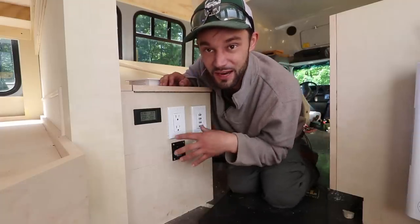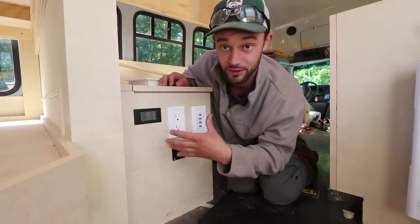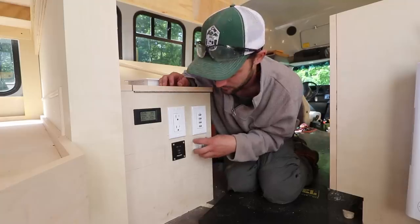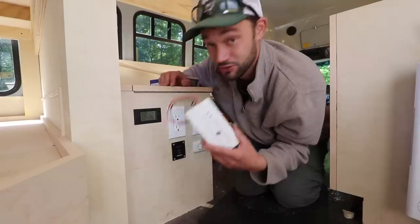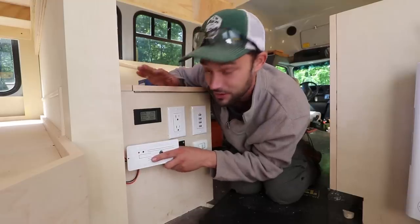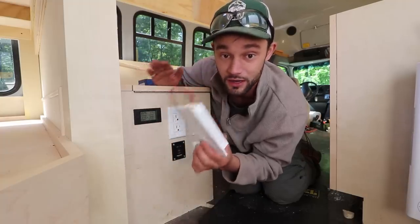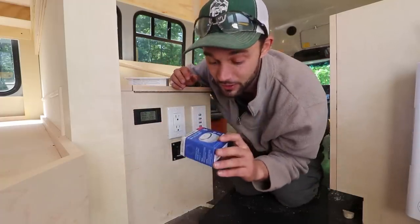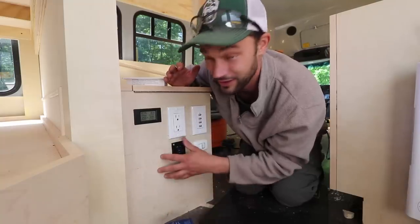Here in the school bus is our main control panel on the side of the couch. We put it here because all the electrical systems are inside this couch — easy to wire and check. We've got battery sensors, 120 plugs, 12 volt plugs, a water pump switch, and an on/off for the inverter. We're also installing an LP and carbon monoxide detector right here, within manufacturer spec — about 4 to 20 inches off the ground — close to any propane sources. Definitely also pick up a fire alarm.